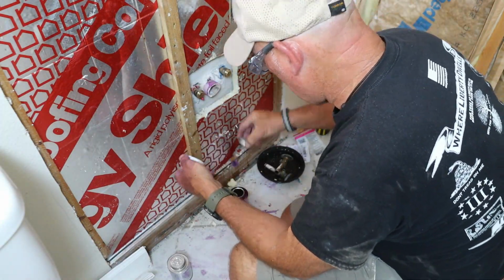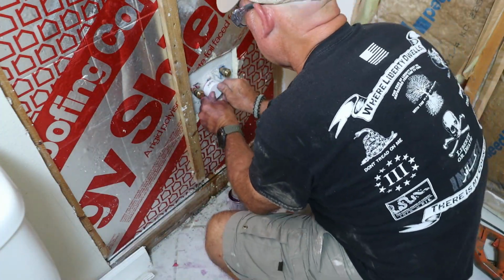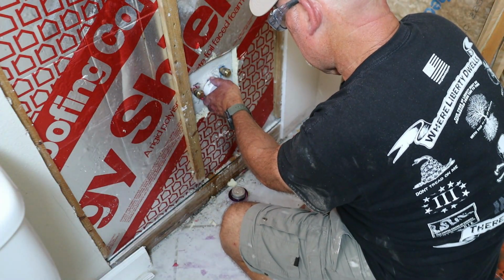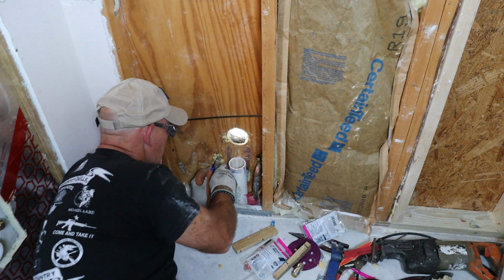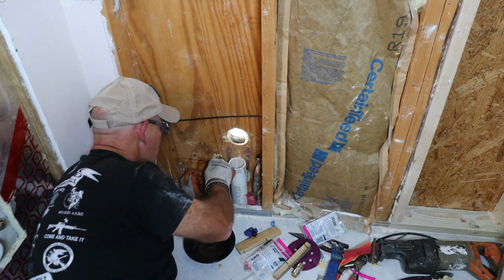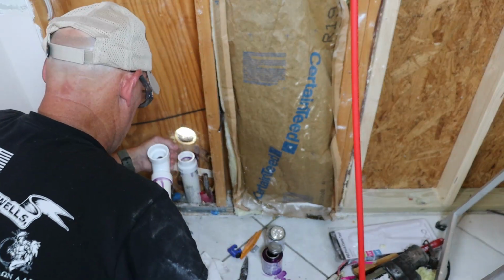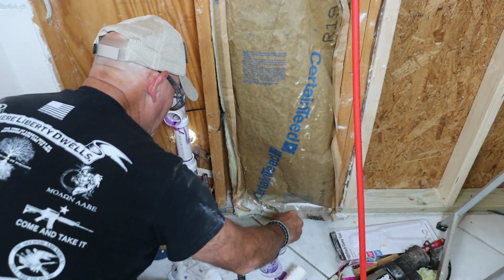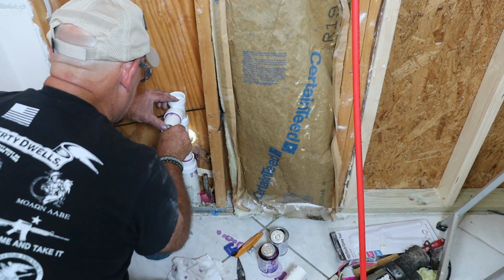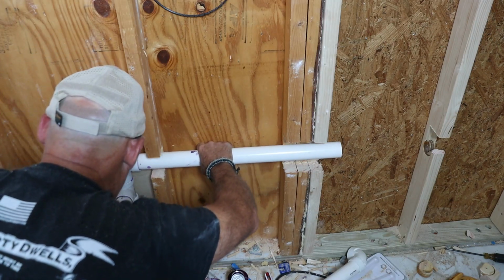For the old drain, I went back to the classics. PVC cap, primer, cement, and done. The plumbing for the old vanity wall is officially capped off and sealed. Now I started prepping the new wall. First, I cut and removed the old exterior supply lines. Then I installed a 2 inch to 1.5 inch reducer on the main drain, followed by a Y fitting to pick up both sink drains. With the rough drain roughed in for the first sink, I added a 90-degree elbow to run over to the second.